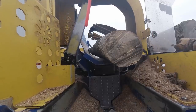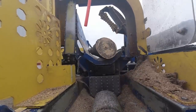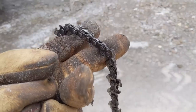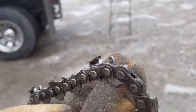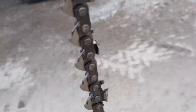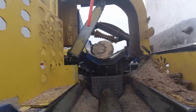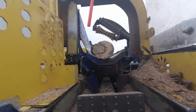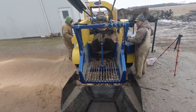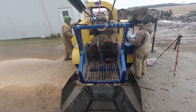We also discovered the chains were another potential issue. The previous renter had sharpened all the chains after an extended rental period, and it looked as if they had all been sharpened too aggressively — we noticed a lot of bluish, burnt teeth, which in my experience doesn't result in a good cutting chain. I think this was likely another factor in the performance issues, though probably not the entire problem. If anyone can explain the science of why overheated chains don't cut well, I'd love to hear it in the comments.